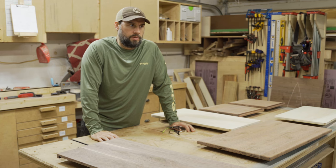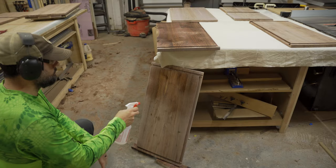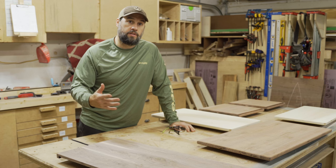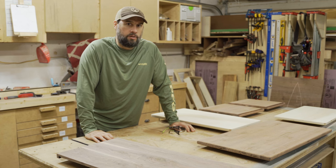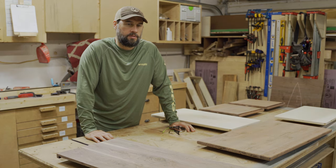Today we literally have to, we sanded up to 120 on everything, we water popped, we have to sand 150, put on mineral spirits, let the mineral spirits dry, and then apply Rubio, and then do final assembly, and that's it for the box. My only concern right now is I think the box needs legs. And so while the mineral spirits is drying, I'm gonna work on that and do a couple things. So way too much to do, not enough time, and yeah.